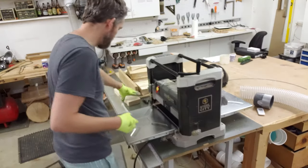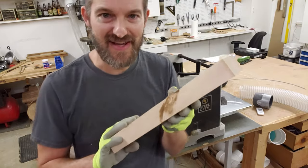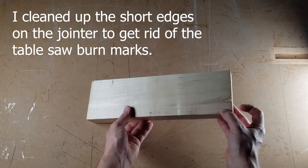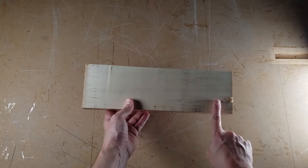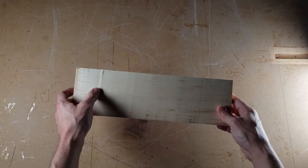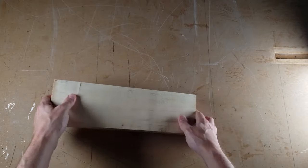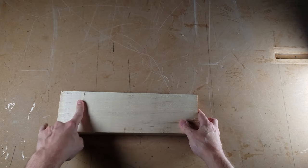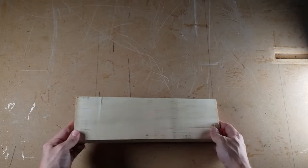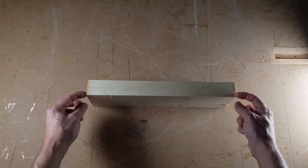Pretty nice piece of maple — this is from a split log, not bad! Here she is in all her beauty and flaws. This part here is where I didn't bring the planer down far enough, but it's not a big deal. You can see the planer snipe right here — that's when the piece is coming out the other end and one of the feed rollers presses it down too hard, causing it to jump up a little bit and bump into the blade. That's okay, we'll clean it up later. I'll probably cut this into three or four pieces on the bandsaw.